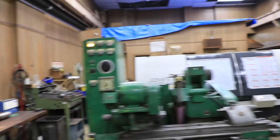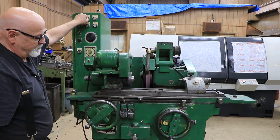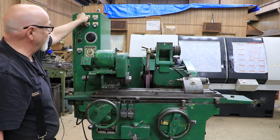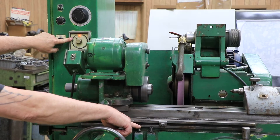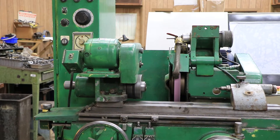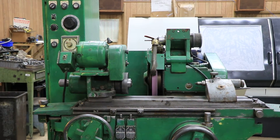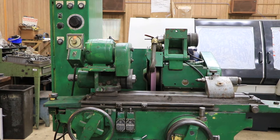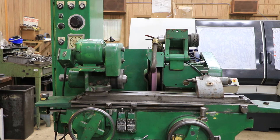Let me show that once again. You go from the hydraulics being off or the hand wheel being in — you can't start the hydraulics with the hand wheel in. When I press the switch down and let go, this timer activates every time. That's your tarry or your dwell, and I can increase it or put it only on one side and not the other. These are all features for grinding.